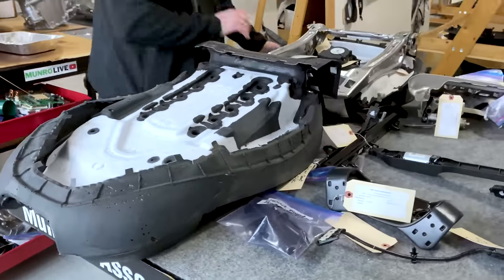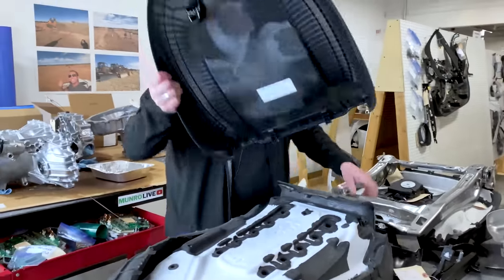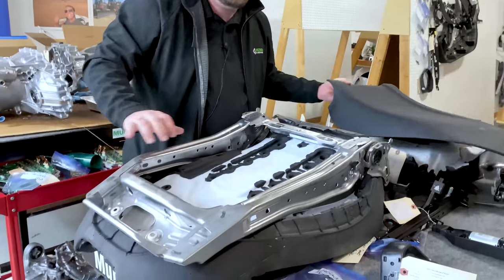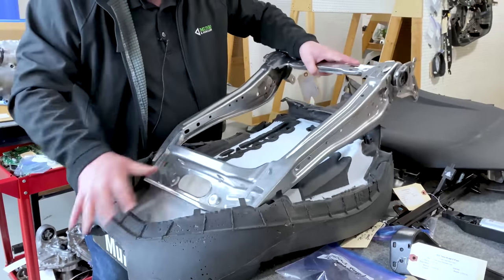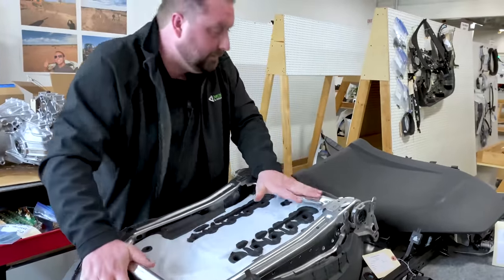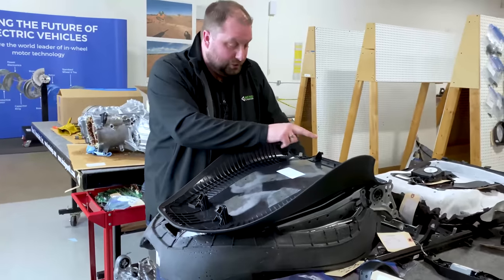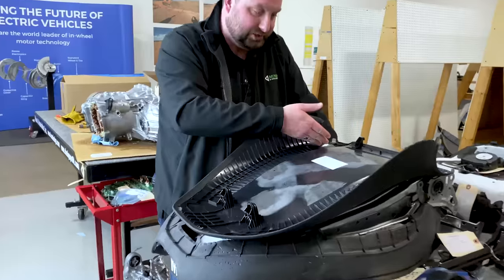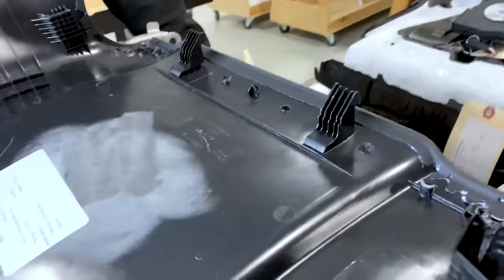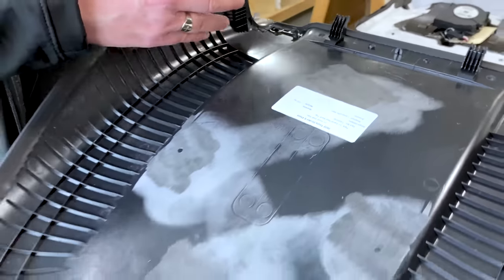Your seat back panel. I was looking at this back panel and I saw something kind of interesting. It's unique to me. I have not seen it before. I don't know if I like it, but let's look at it. Here's your back panel. You have lower hooks, which are going to grab into your structure. Normally, what a seat would have is hooks on one side, and then some sort of a snap feature on the other. It would either be a molded-in snap, or it would be some sort of a purchased fastener.